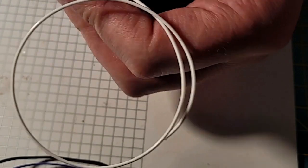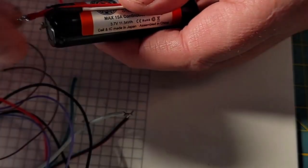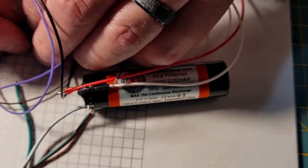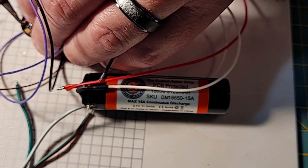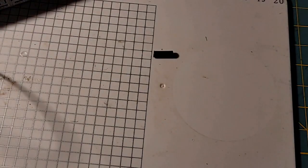So this is our battery negative and battery positive. Now both those are going to be routing into the chassis like that. And I'm going to take our red wire from the Neopixel connector, and I'm going to join it onto those red wires. So there's going to be a merge here, and it doesn't have to be anything humongous. I want to triple check this solder here, so I think I'm going to try and improve that solder, because I am going to use this positive that we already have. And I'm happy with that. You know, the red wire is already soldered in there, because that would be a beast to solder that thing together when it's in there.